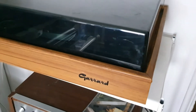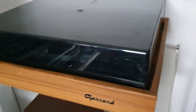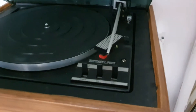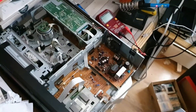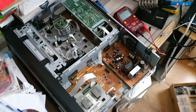I've given the lid a bit of a polish and repaired the damage at the back - it's looking pretty good to be honest. I need to touch up some of the solder joints on the point where the tonearm meets the phono connectors because there's a bit of noise when you're playing - a bit of feedback - so touching those up should solve that. It's a lovely looking deck. I recently discovered in my mum's loft I've got the Garrard 100SV model, so I'm going to be bringing that down and giving it similar restoration treatment. Anyway, if you've enjoyed this video, don't forget to hit the like button and subscribe - I'll see you next time, thanks for watching, take care.